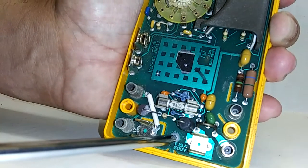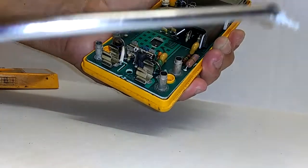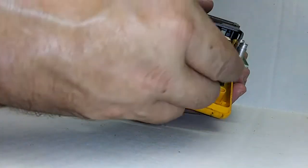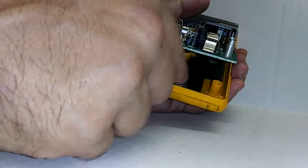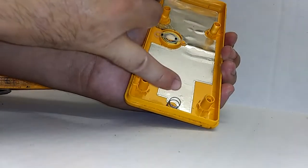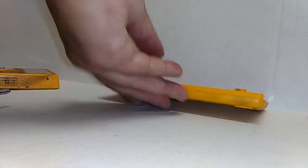We're going to remove this screw right here — removing it will free up the main PCB. Don't lose this little screw; you need it. There is a spring action here — a spring that goes between the main PCB and the bottom case. Be mindful of this. Make sure you're working in a clear area so in case this little spring pops out, you can find it easily.